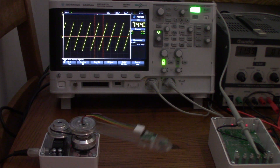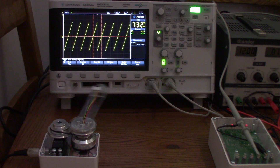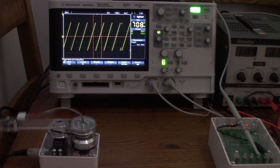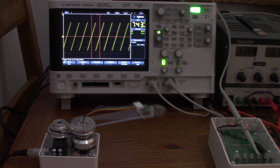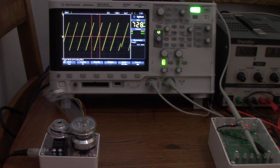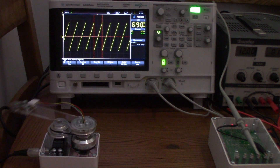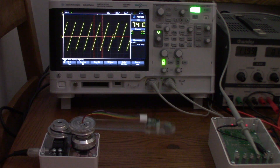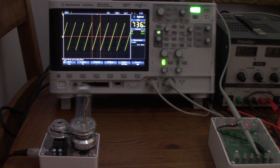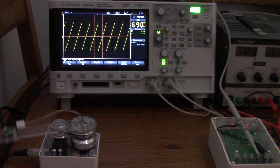That's 170 microseconds offset. The frequency is now 815 — you can tell this has really flattened off. It's reading 814 to 815, so very little difference. I'm now going to jump drastically to 250 microsecond offset and see what we get — we've got 818 millihertz.